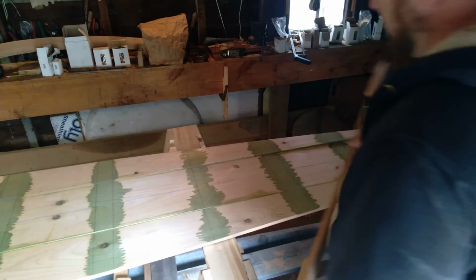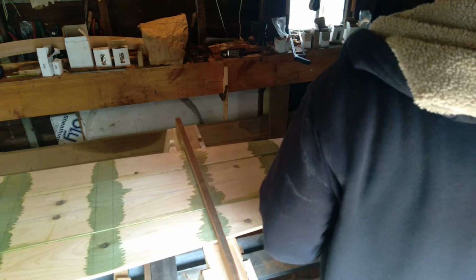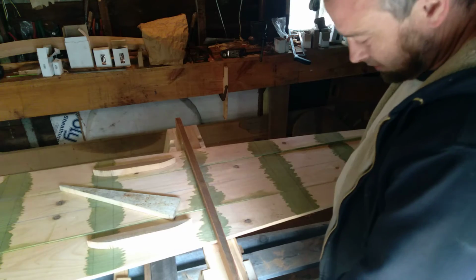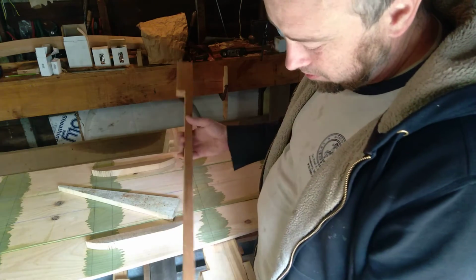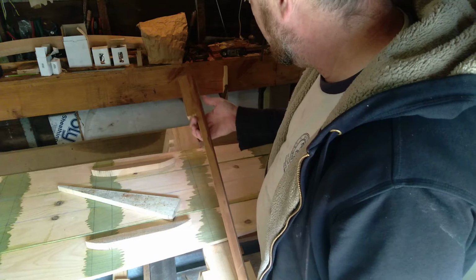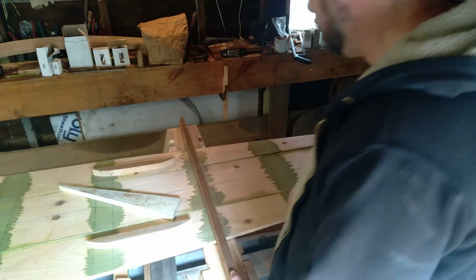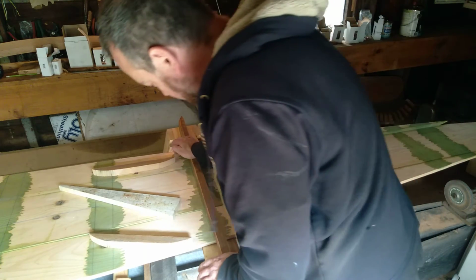So first thing to do is get down the other bar clamp, a loft here, and the clamp pads and wedge that go with it. See, these bar clamps are pretty simple things. It's just a piece of wood beveled slightly on the edges so that you're not pulling directly on the edge of the bar. It just goes down right over top of the sawhorse, so it sort of captures the bottom.